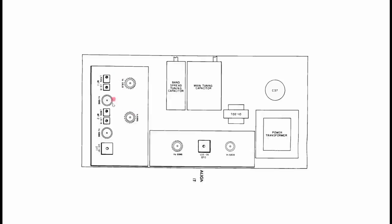Notice that the signal direction generally starts at an antenna connector, you work up this way, come down through the front end, keep going through the IF, take a left-hand turn and go through the IF stages into the audio stages, the transformer, and out. It's a very nice layout. This L-shaped layout is exactly right for receiver design. The tuning capacitors are on the top panel where they're not going to be influenced too much by what's going on underneath the chassis.